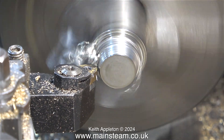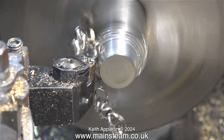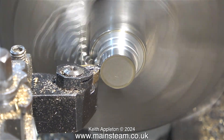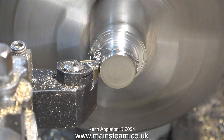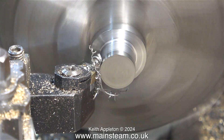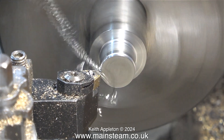I can only take shallow cuts. What I'm doing is reducing the diameter of part of this piece of bar, so I can use my parting tool to part it off, because the small parting tool I use in the Boxford lathe is a bit too short to go all the way through it. I'm using one of two carbide tip tools that I have, and they're very good and generally speaking turn the metal really well.